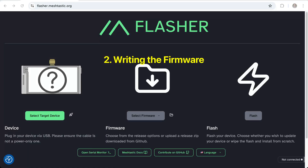When the board is connected we can flash the firmware. To do this we need to go to flasher.meshtastic.org. There are two important notes: first, it works properly in Chrome, so browsers like Safari or Internet Explorer will not work. Second, in your system settings this board must be detectable as a serial port — a USB serial port. You can open your system settings and verify that the port is available, because without the port this tool will not work. If nothing works, check the USB settings, your computer, or the cable. I had two Meshtastic boards of a previous generation and it turned out that from three cables, two were not working.